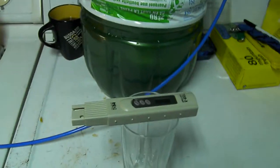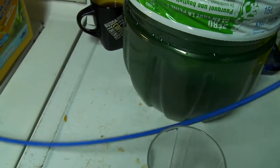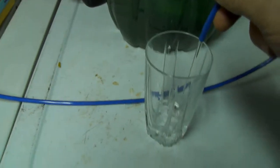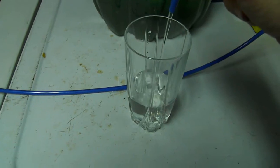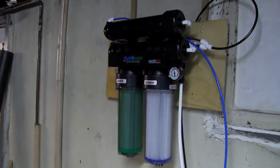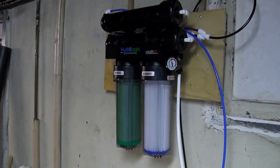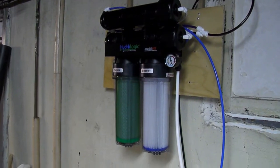I'm going to draw a sample of this RO water from the filter system and we'll measure that while it's running. I'll just pull that hose out. By the way, I'm running a one-to-one ratio. There's a little thing on the back of the filter system — you can change it to two-to-one, where you get two parts dirty water that gets filtered out to one part of the clean water coming through the hose.